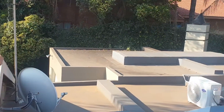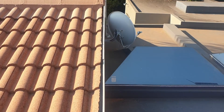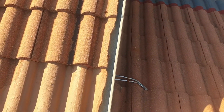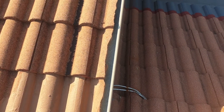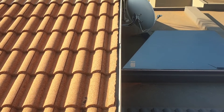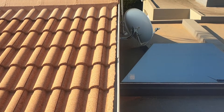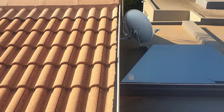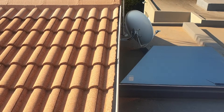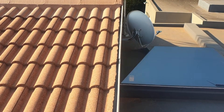What I want to show you today is on the gable ends of the roof. In this case they have fitted a fascia board, which is not the correct way to do it. A barge board should be fitted on the gable end of the roof. A barge board has a lip and it goes over the roof tiles, and it protects the exposed roof timber as well.